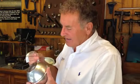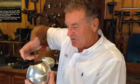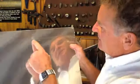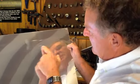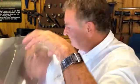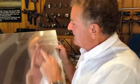Now the boss is soldered onto the can — that's this section here. I'm going to make the neck; the neck is the little piece that stands about this high, and that is then screwed into the can and then it's silver soldered all the way around. So what I've done here is I've already marked them out on the silver sheet. This section here is the silver neck, and this section here is a tapered flue — that's why it's cut on the angle. The reason for the taper is it's very easy to locate the cover of the milk can, and then as you push it down it becomes progressively tighter. So I'm going to cut that out now and then turn it round for the next stage.